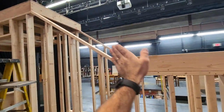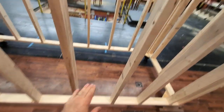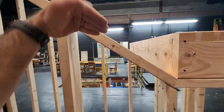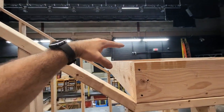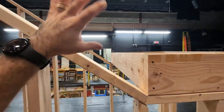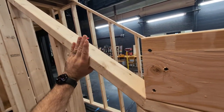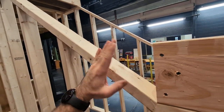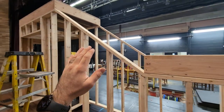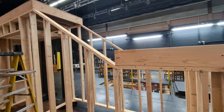Now the stringer being in there rigidly attached to this matters, because this thing being in a horizontal flat aspect can bow a lot easier than if you were to roll them up on their edge, just as a 2x4. So when you come in here with a stringer made out of a 2x12 and attach it to there, you turn this whole thing into what amounts to an L channel. You make, essentially, angle iron to strengthen that. Sort of same situation with that. And you take a lot of that bounce out, right?